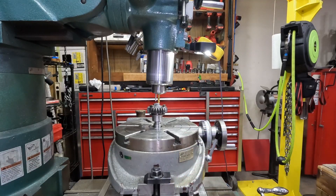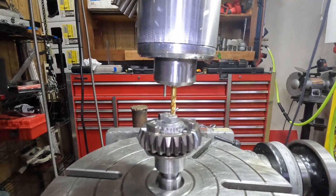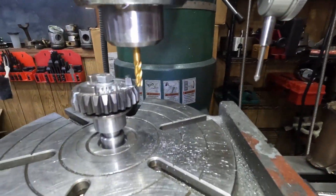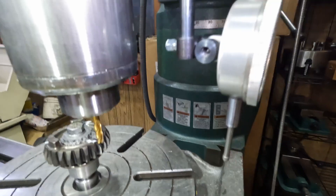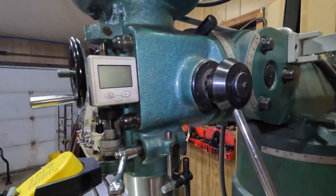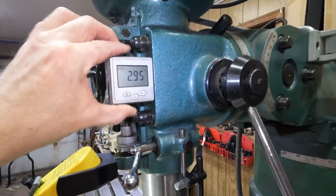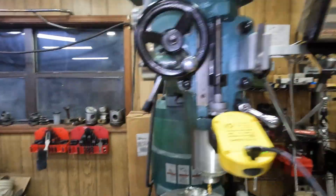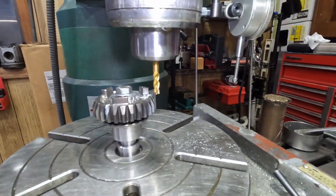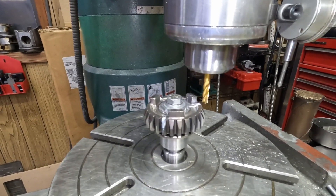So what we do is — if you can see in the middle — that head is set at three degrees back that way. I've taken the first cut here on this gear. You can see it's got a fresh surface and we're at three degrees. Enough talking about it, let's just cut one. Like I said, I've already taken the first cut, so now that it's all set up and the hard part's out of the way, I'll just show you what the actual metal removal entails.